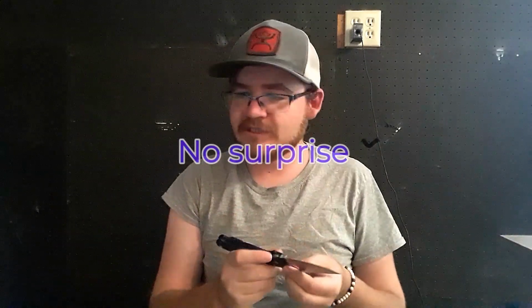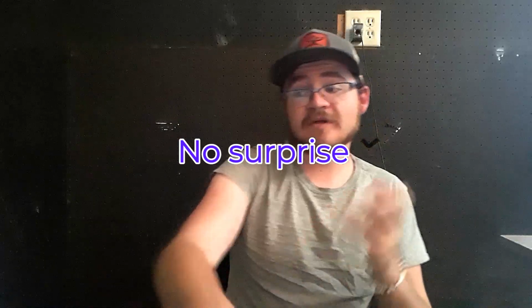This is just skating right off. So this quartz is harder than this S110V. Significantly harder, I will say. So let's see what a Mohs hardness of 7 is equivalent to in Rockwell. Yep, off the charts. I was kind of thinking that, because 6.5 is 69 HRC. The suggested range for this conversion, the Rockwell C, is going to cap out at 69. So yeah, with a hardness of 7 and up, you're just going to be completely out of the Rockwell C scale.